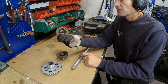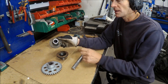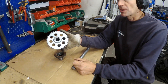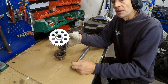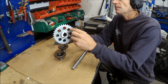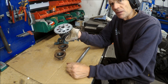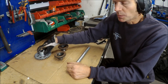These are flanges I took from another Lada Neva transfer gearbox I had, and I drilled the splines away. These are ordinary bearings, and this is a sprocket. I calculated the maximum top speed with the gearing, shafts, and these sizes of sprockets. It is going to be around 50 to 60 kilometers an hour, which is quite a handy speed for this kind of vehicle.